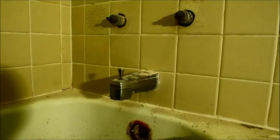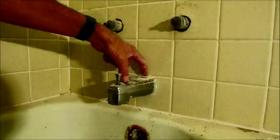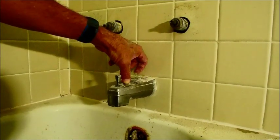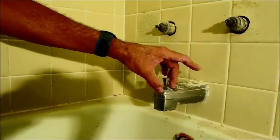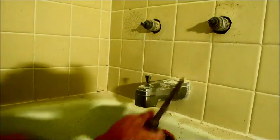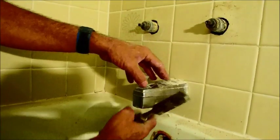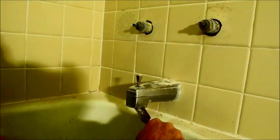It's all garbage. The tub spouts themselves — there are two or three different ways that these fit. Ninety percent of the time it's going to be a screw-turn style. The pipe sticks out here, there's a male threaded end on that pipe, and that goes into the female threaded end on the spout — it's just a lefty-loosey type of thing. Sometimes you can get them off by hand, sometimes you have to force them off with large channel locks or a pipe wrench.